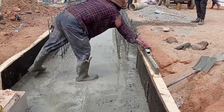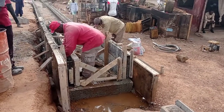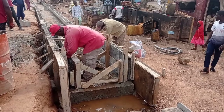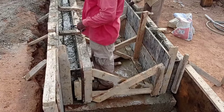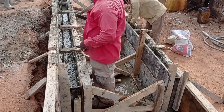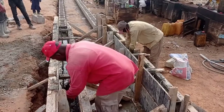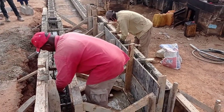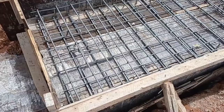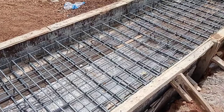The mason is tapping the concrete and also making sure that the water flows out. After pouring concrete into the base, you can see that we are putting the shuttering for the walls. The thickness of our walls is also going to be 200 millimeters, while the total length of our culvert is maintained at 4 meters.